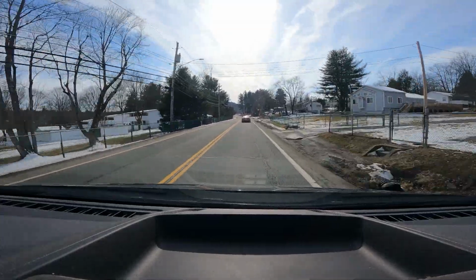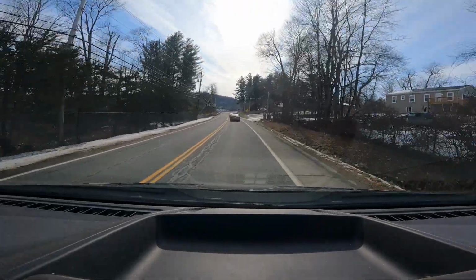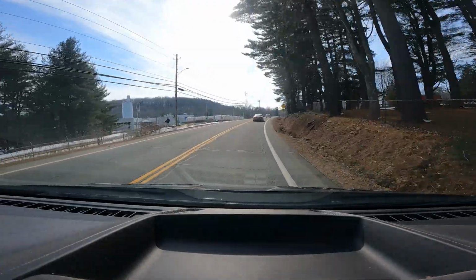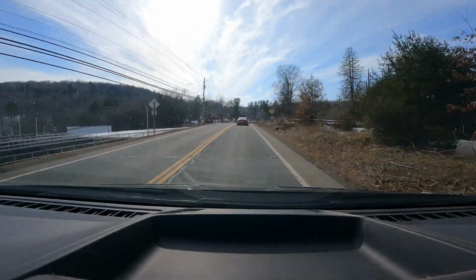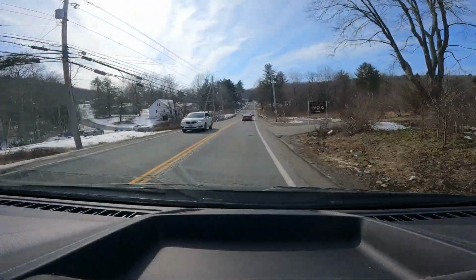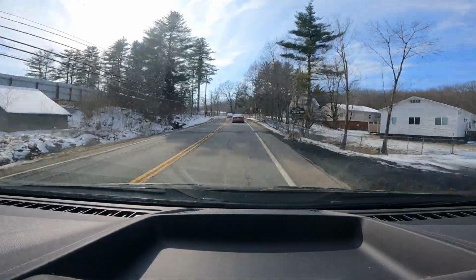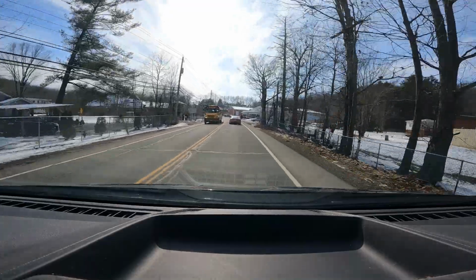All right, so we shimmed that door out, put a combination lock in there, and then the neighbor saw me on the camera, so he asked me to stop by and check his lock. It was just, you get that snow load and they come up and they crank on it until it snaps the thing off inside. It used to be that it would bend the tailpiece. Now they made the tailpiece so rigid that it'll actually break. It'll strip the internals out of the latch. It'll break the little post inside loose, and then where it retracts, it just spins around in circles and won't do anything. And the latch, you can literally, like I showed you, just pop it in and out by hand. Anyway, we are headed to Orange County. We're going to go do this 13 Lexus now. I'll be back with you.